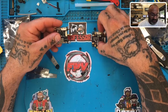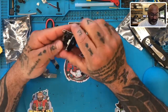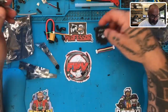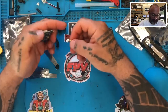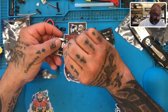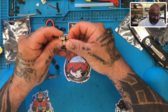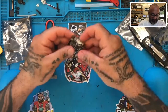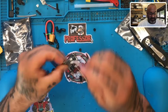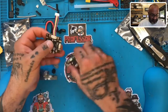So in this case, the question is: what do you do to bring in 12 volts, for example, or if you need more than that? Looking here, it actually looks like right here is where it's at. So if you're going to use your own ESC — I think the confusing part was — it has a five volt output coming from this location right here. Let me position this correctly — so you have five volts coming from here.